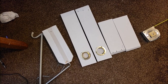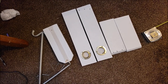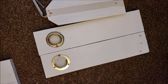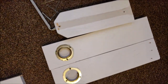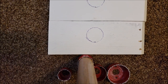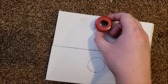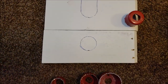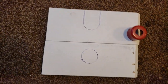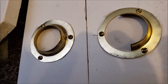If you really wanted to go crazy you could screw it and glue it, but I like just screws — I think it should hold up fine, especially if I get into the studs, and it also allows me to move it around in the future a lot easier than trying to rip glue off the wall. These pieces over here are already designed to fit the dowel in there, but over here I'm going to do something a little differently. I'm going to pick the hole saw that best matches my job, trace out a little hole, and the dowel is going to slide down into that notch — that'll be really sturdy, arguably even more sturdy than the previous setup where it was almost falling out.